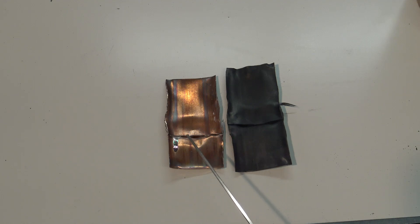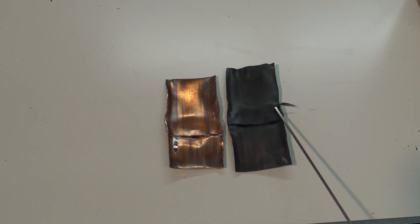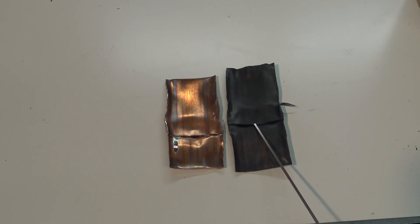You can see the filler material made its way all the way through on the one where I distributed heat evenly throughout the cup — there's a nice line of filler material along the ridge line. On the incorrectly done one, I could actually pull the pipe apart with pliers — that filler material probably never made it past the ridge line. This could pass a pressure test, but who knows how long before it leaks. This is the proper way to do our brazing, and our customers are going to have a much better system after years of use if we do things the right way.